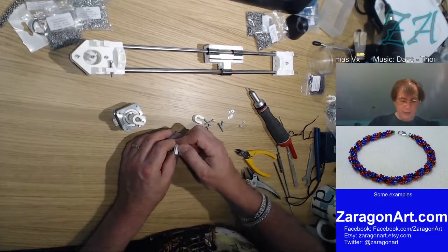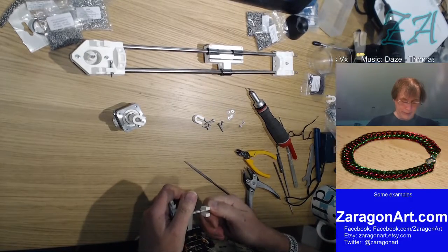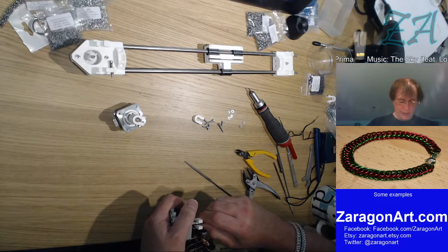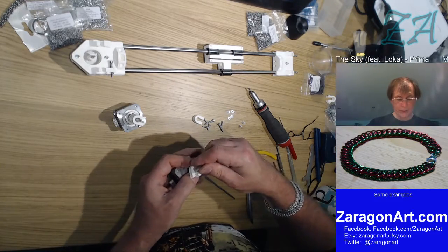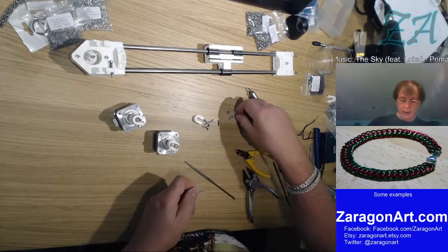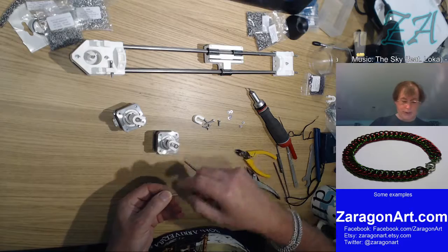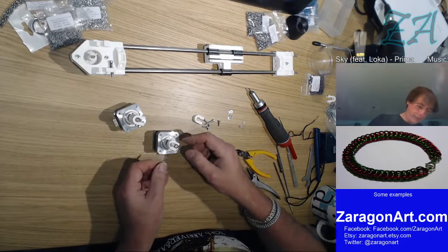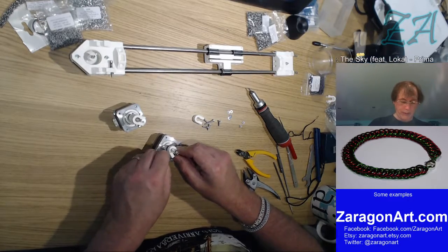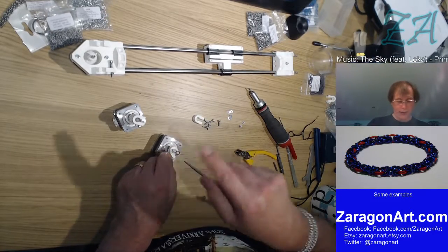So we push that over the top of there, we'll push it down and then pull it back and find where the D is, so the flat, because that goes in between these two apparently. That is almost certainly so that this clamp, which is round, of course, gets the most pressure on the motor shaft, which it wouldn't be able to do if the flat was in somewhere in there. That would be a whole area that didn't get any pressure on it.